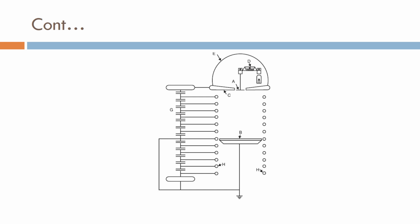Now, the basic principle is: if the electric field is produced by the voltage V between a pair of parallel plate disc electrodes, the force F acts on the area A of the electrode, for which the field gradient E is the same across and perpendicular to the surface.